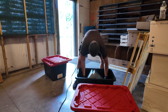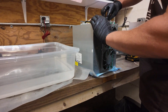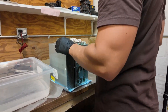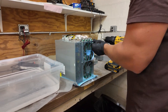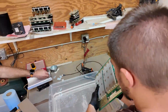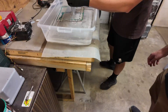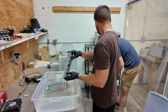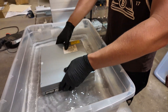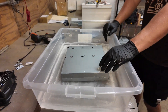Next, we'll unload all the miners and prep for cleaning using a dielectric solvent. We have to unplug all the connections and pieces in the miner, including the hashboards and power supply. After everything's unbolted, we'll dunk each component into the solvent to remove the slimy dielectric fluid. After a few minutes, we'll shake the excess and store it on a rack to let them dry. We'll do this for all of the hashboards, then clean the power supply — dunking both sides a couple of times — then shake off the excess and move it to a drying rack.